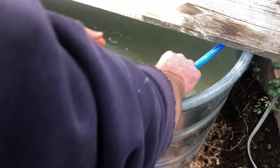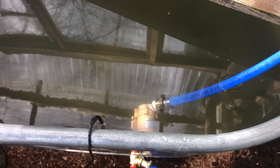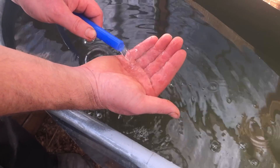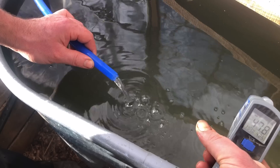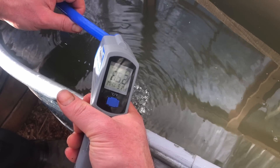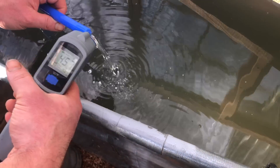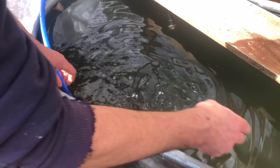I think what I'm learning is I'll need to connect this directly to a power line rather than a solar panel so we can get 24/7 movement. Now when I plug this in, it's a much slower rate of flow through a much longer circuit. This morning when we came out here — with the air well below freezing — there was a huge amount of steam coming off. The ambient water is around 47–48°F and it's coming out at 87–91°F, so roughly 88°F. Quite a difference, and it runs at that temperature for a long time now because of the longer circuit.